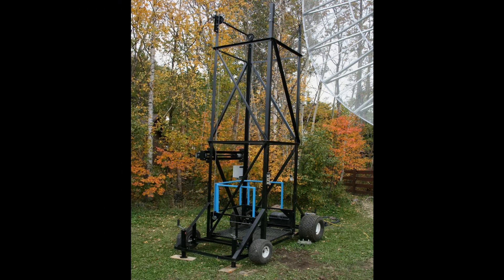So this is what it looked like when it was all finished. I put wheels on it so I could move it around — it becomes a very handy work platform to work on the dish itself. The original plan was to have it bolted to poles in the ground, but I decided to just have four guy wires to hold it in place. It's a lot steadier that way, and probably a lot safer.